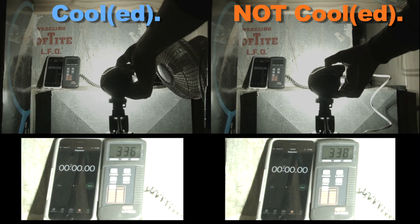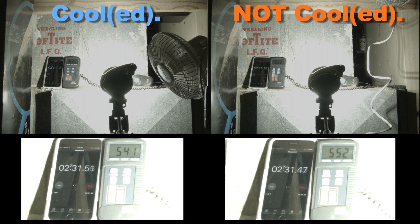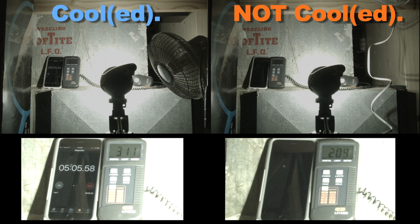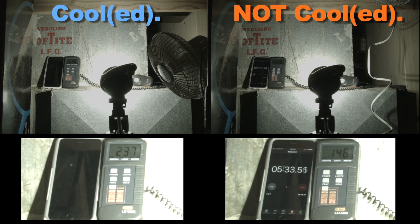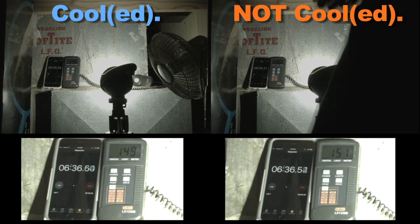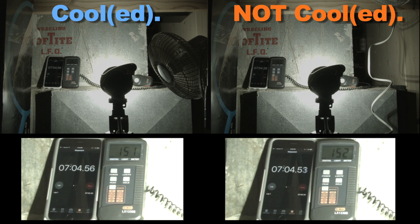For this review I'm doing a new test: let's see if there's thermal regulation or timed regulation on Turbo Max. Basically they should step down at around the same time if it's timed regulation; with thermal regulation and a cooling fan on, it should take longer. It's not super scientific — one has a fan, the other doesn't. Both do seem to start dimming around the same point. I noticed about a 15 to 20 degree temperature difference at 3 minutes in: 165°F on the non-cooled side and 145°F for the cooled one. Both stabilize at about 7 minutes to the same brightness. At that point you're still pretty hot — about 150°F near the switch and 120°F near the tail cap. If you want to run this for more than a few minutes on max brightness, bring gloves. You'll be fine using it in bursts under 2 minutes without gloves, or in a colder climate.